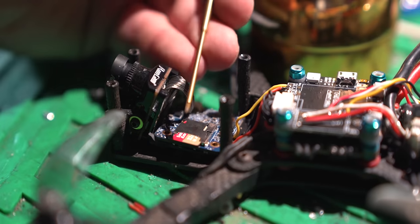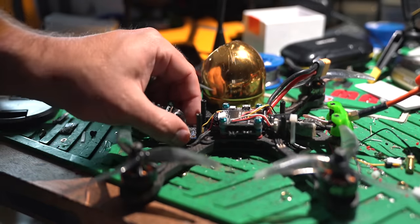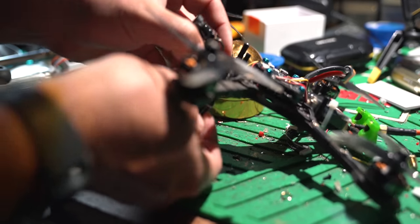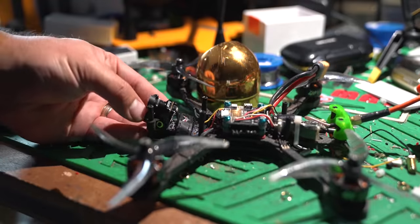I'm confident that I'm going to lose my SD card eventually. It is pretty easy to push the SD card out, so I think in a big crash or a bump it's going to eject. What I did was add a strap around the outside of my frame that holds the SD card in place, so if I have a crash it likely won't eject. The split comes with pieces you can use to keep the SD card in place, but you can only use those pieces if you have your board mounted in the stack — which I don't. So they basically go between the screws and the stack, with a little plastic bit that folds down over and holds the SD card in.